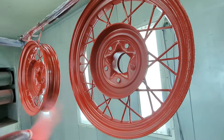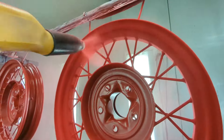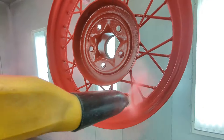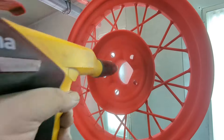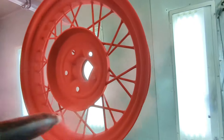Now you can see my settings — this is technically the third coat, but the second coat of the red color. Once again, I'm dumping this powder on. It's not crazy excessive — I'm sure you guys have seen these guns turned up and they can get pretty wild. But this is a pretty heavy coat of powder, especially being that it is the second one on these particular wheels.